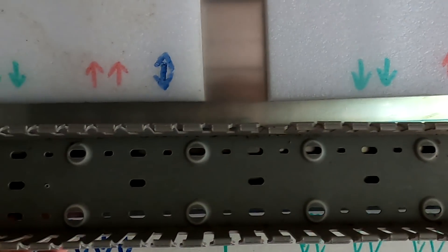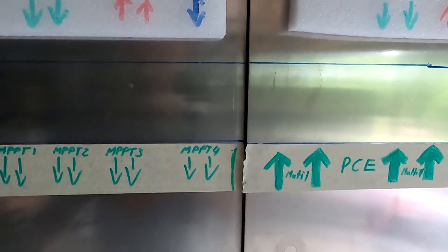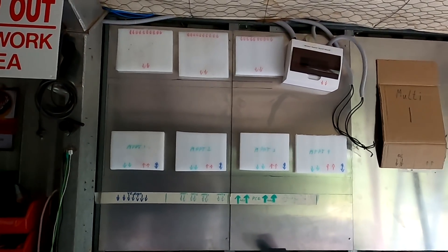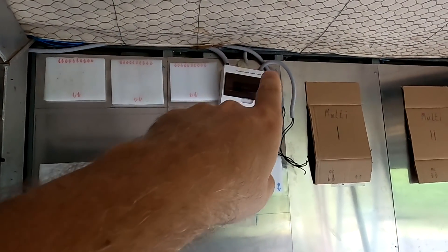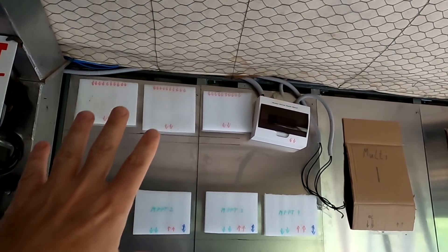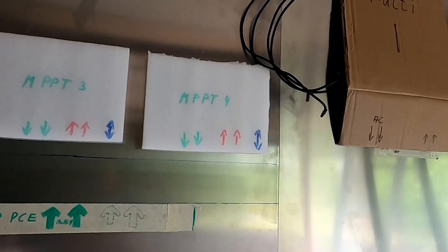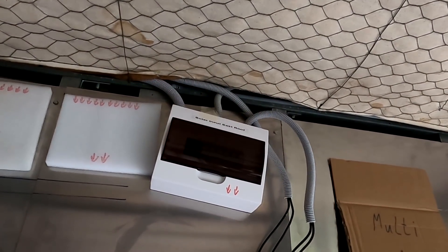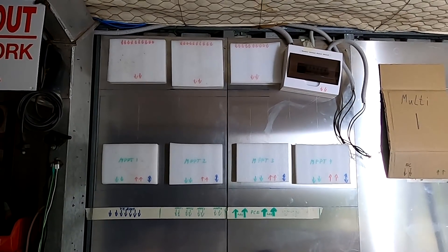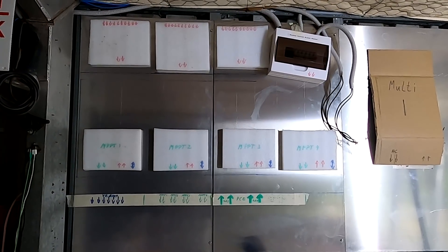Hence the idea to go with the slotted duct down here, because there will be tons of cables going in and out on both sides — perfect for this application. I like this design very much. We'll probably start with the switchboard in that corner, move the west roof section next to it, and leave the others for future expansion. We start with MPPT 3 and 4 because those cables are just long enough. After 45 minutes of thinking, I think it's a very good design — the space in between is nice for further equipment we may need for our solar panels.